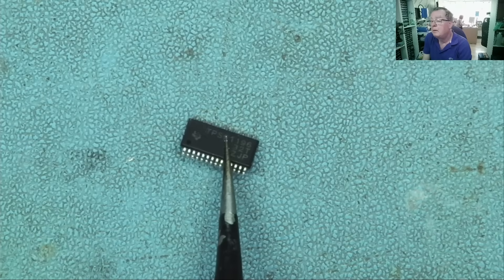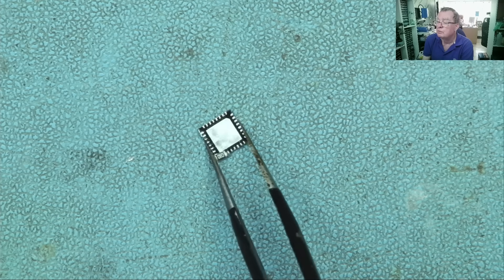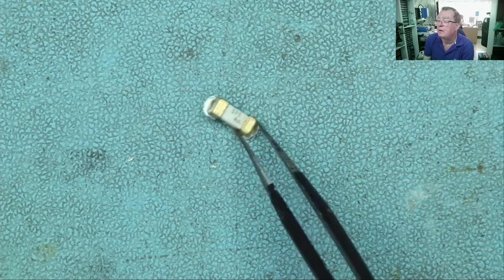The large inductor is really nice and clean. This chip with the pad underneath was nicely salvaged. The large MOSFET came off nicely too. For the QFN chip — this had a large pad underneath and I have a resistor stuck to it, but we could easily remove that if we want either the chip or the resistor. A fuse came off just fine, a small transistor or voltage regulator — no problem. Another similar device with a pad underneath unsoldered just fine. We also got off a small SMD diode and a few small components, just picking them off the board one after another.